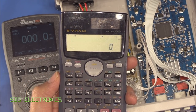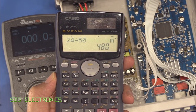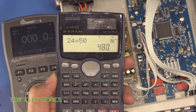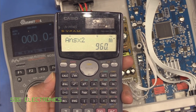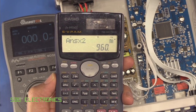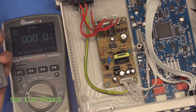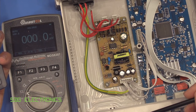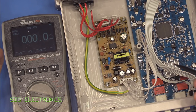We can calculate: 24 volts into a 50 ohm load is 480 milliamps worst case, and with two channels that's basically one amp for the ±13.5 volt rails. The 5 volt rail is really only going to be driving the logic and the LCD on the front panel — by inspection of what's on the PCB that's only going to be a couple of hundred milliamps, but we can very easily design a 1 amp 5 volt rail.